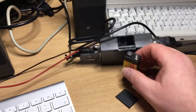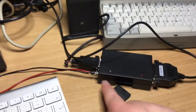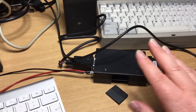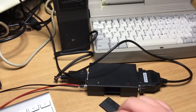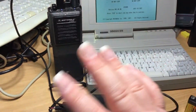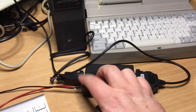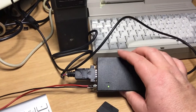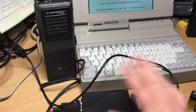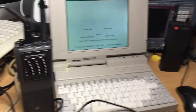Even the genuine Motorola radio interface boxes originally had the same issue. The 9-volt batteries in the compartment underneath the genuine Motorola RIBs had issues — it wasn't until you plugged permanent DC 12 volts power on the input that you got rid of the issue. I was struggling for a long time trying to get this to read, dealing with what I thought were PC and radio issues, but it's just powering it from the external DC source that sorts all your problems out. Fully recommend it.